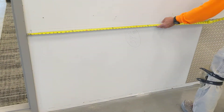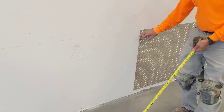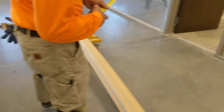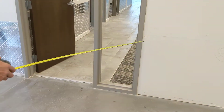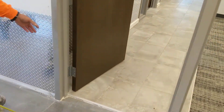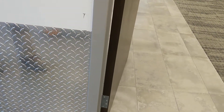We got two pieces left. I already measured them. I'm cutting them a quarter inch short since they get trim, so I'm leaving the quarter pretty much in the middle. They all get trimmed, so it doesn't have to be real precise. It's not getting trimmed up against the door here, so I'm just keeping it tight there — tight against the edge because you don't have trim there. But it's still clean, and I usually put the factory edge against the door.